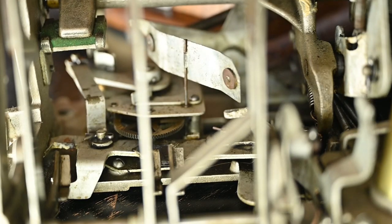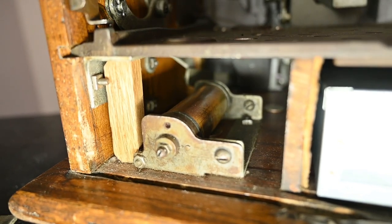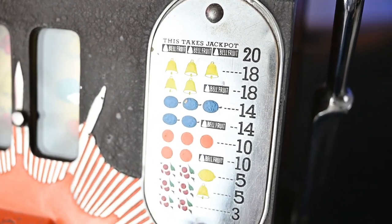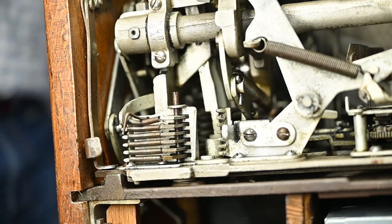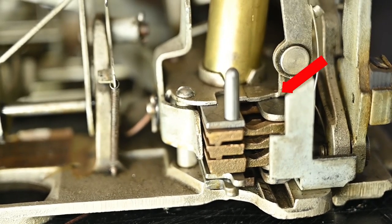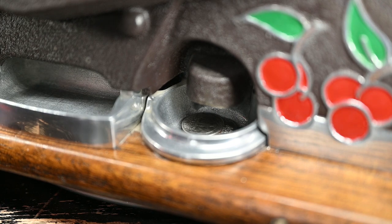You can adjust the speed by folding these wings in to go faster or out to go slower. The pneumatic rod helps slow down the handle's return — one reason is to not make a clunk, and the second is to give the cycle time to complete before the handle is pulled again. The position of the stopped reels determines whether you win a payout or not. The winning combinations and payout amounts are shown on the front metal plate. Notice none of them begin with a lemon — if your first reel stops on a lemon, you know it's a losing spin. As each reel stops, long metal fingers are pushed into the reels. The bottom part of those fingers are hooked up to springs that move stacked brass slides which have openings the size of quarters. Depending on the ending position of the fingers and slides, they'll either block or allow coins to be released from the copper payout chute, and the quarters drop out into the payout slide on the outside of the machine. It's a complicated formula — the number of fingers pushing through the holes in the reels and their position determine what gets paid.